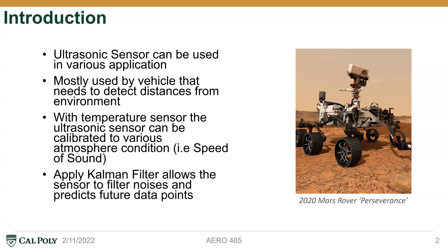Part of the important thing to operate the ultrasonic sensor is that we have to calibrate it before it starts to take data. Without an accurate reading of the speed of sound, the sensor itself wouldn't output an accurate distance, since the distance is calculated based on the speed of sound because it's emitting ultrasonic waves. So it's really much related to the speed of sound.